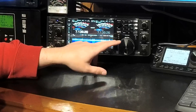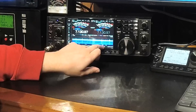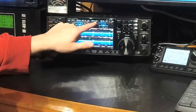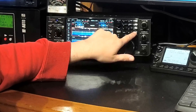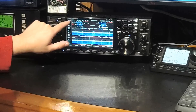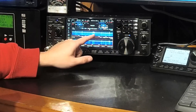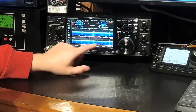So we've turned dual watch on, we've turned tracking on. If I press dual here now, you'll see two scopes. They're both the VFOs, but they're both being fed through antenna one, as you can see. So to switch the second VFO, the best way I've found is to press the main-sub button, then press that. Now it's listening on antenna two, which is my vertical. There's a G5RV up about 45 feet, and a full-size quarter-wave vertical on the sub VFO.